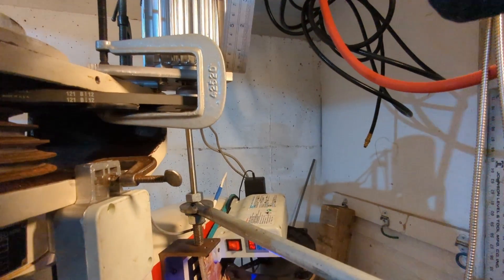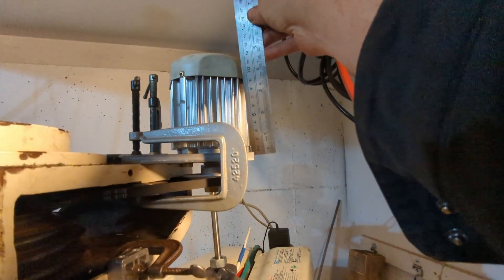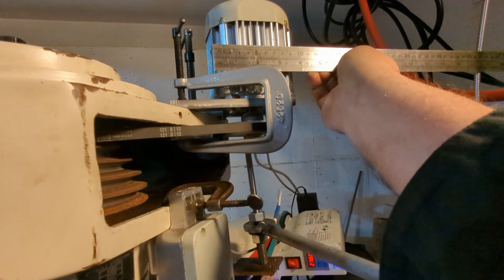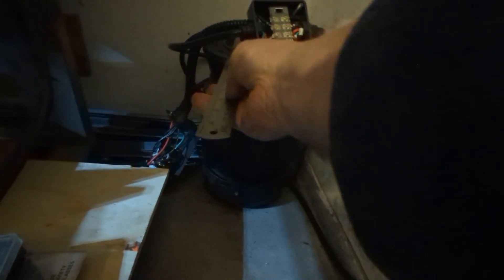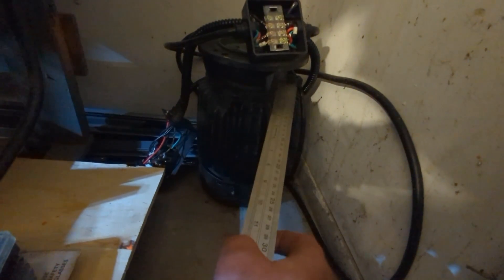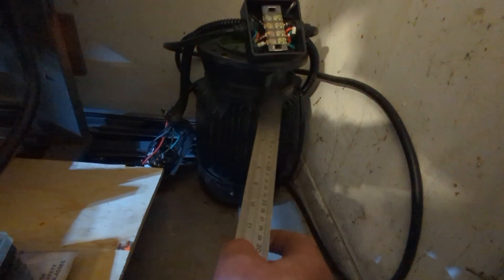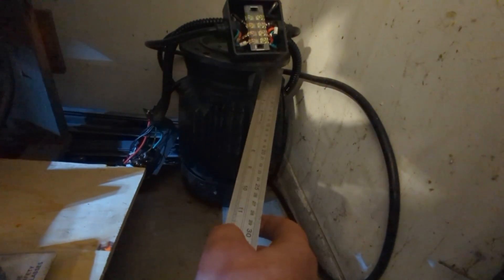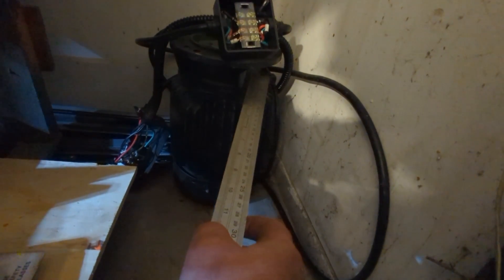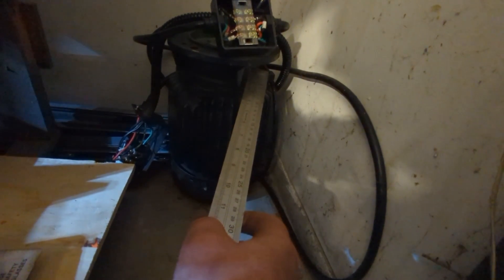To give you an idea of how differently sized the motor is: this sewing motor is five inches tall and about four inches across. The original motor back in the corner is 13 inches tall and about eight inches across. That original motor is two horsepower single phase, and I don't have 220 in here yet. The pulley system on it was terrible, so I decided to swap it out and get variable speed control — and man, the thing is working like a champ.